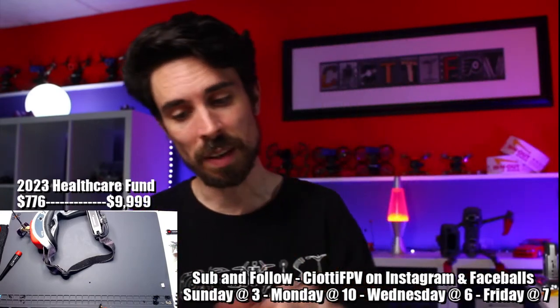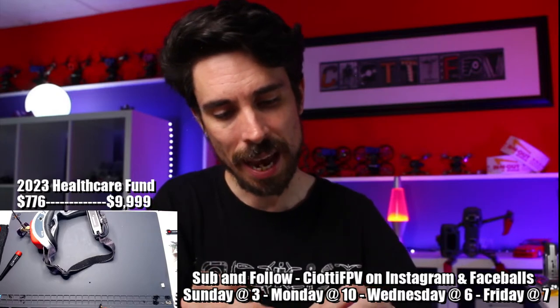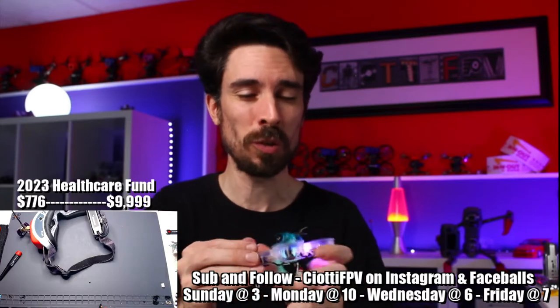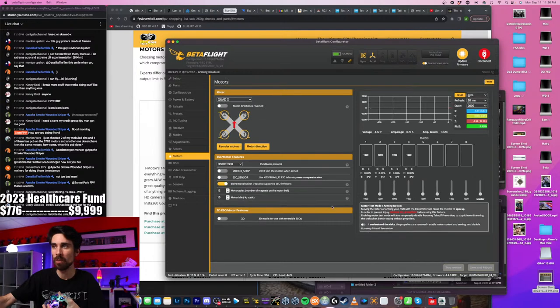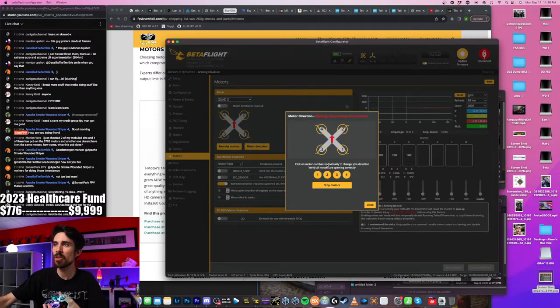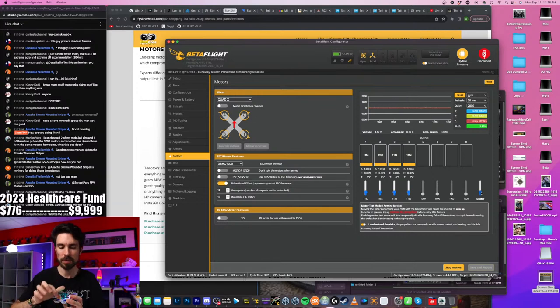Let's see if the motors spin up, that's going to be the first thing we do here. And then if they spin up, let's get them spinning in the correct direction. I'm also going to wind them up to 100% throttle to see if they all spin at roughly the same RPM. Because I might have hurt one or more of them with the stupidity. Understand the risks. Wizard, start and spin. They're all spinning now. That's amazing. Motor one is wrong. But, well, let's do this. They are all spinning in props out orientation now. Oh no, I already put the propellers on for props in, so we're gonna reverse them all. Stop, close, turn this back on. Let's make sure they're all spinning the right direction. Now they're props in, props in, props in, props in. Okay, so we're good. Now individually I'm gonna ramp these things up and we're just gonna listen to make sure that they hit roughly the same pitch.